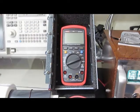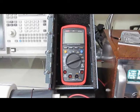So it's not like they changed out the PTCs. The resistors all look like they're the same. So the original 139C failed with a positive 3.7 kV transient. It was in the diode test mode. And you could see, and I don't know if you remember, maybe I'll splice in some footage of that, but it had overheated some traces and it blew out a PTC.